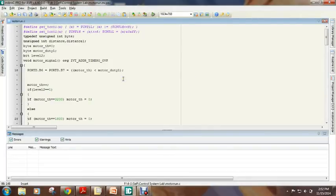This is the microC code of the project. Here we have used pulse width modulation to control the speed of the motor, and to do this we used in the code the timer 0 overflow interrupt. In the variable definition, the variable distance is the actual distance measured from the lower sonar, and distance 1 is the actual distance measured from the upper sonar.